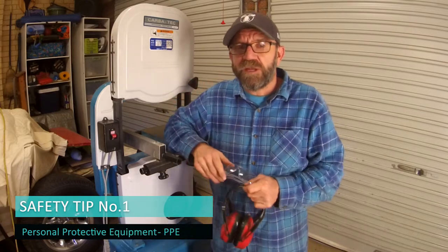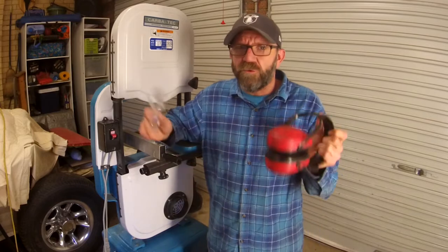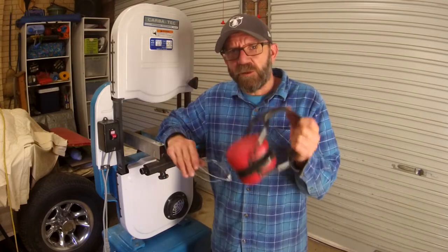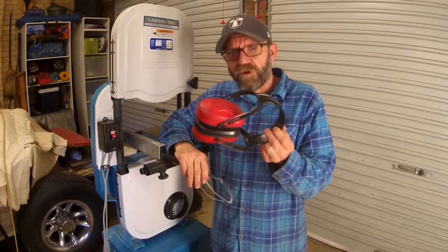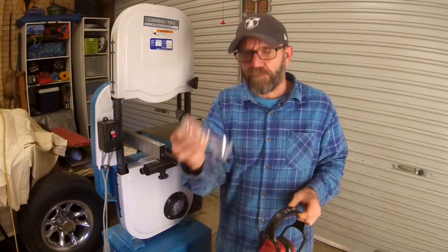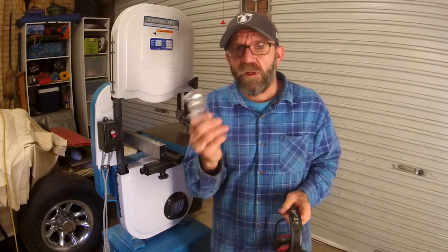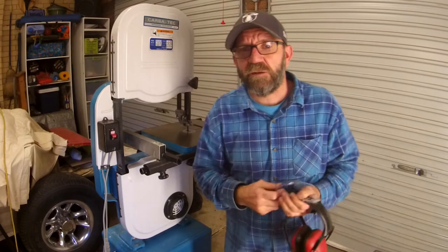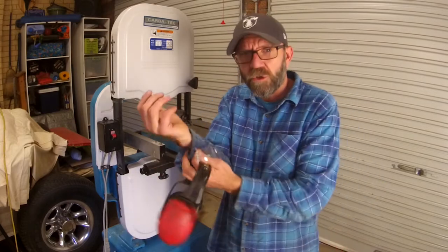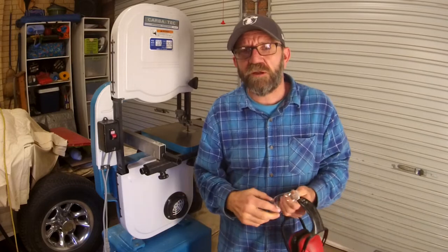All right, now I've got 5 safety tips that will keep you out of harm's way, you and your family members. First one, it's a rule for everything, is your PPE, your personal protective gear. I've got my earmuffs, I've got these special shatterproof glasses, but make sure you get safety glasses of some sort, super important. With the bandsaw in particular, please make sure you don't have any kind of loose clothing or jewelry or anything that could get caught.